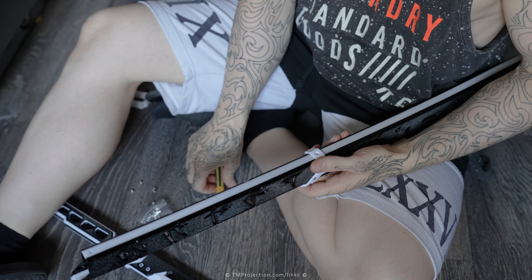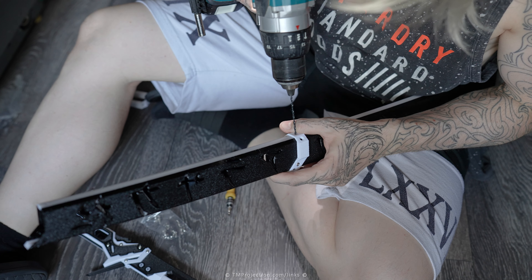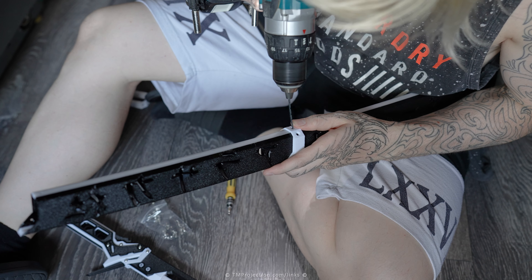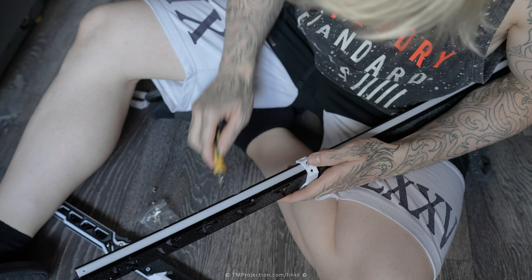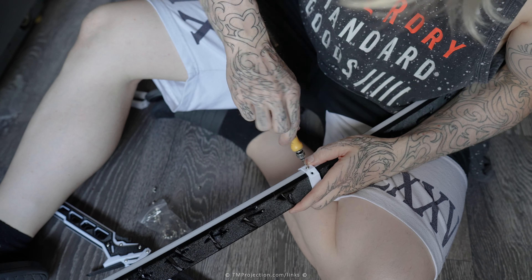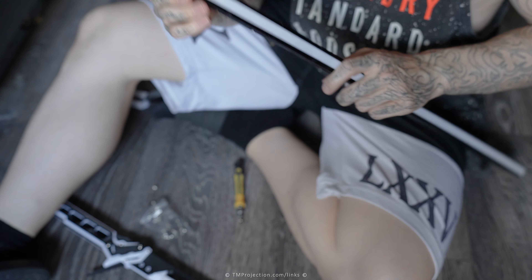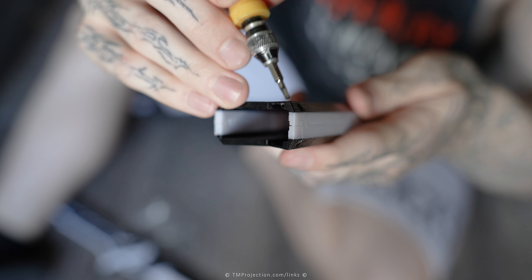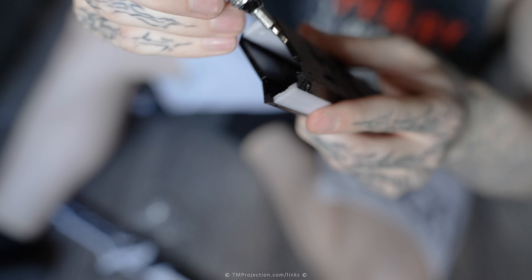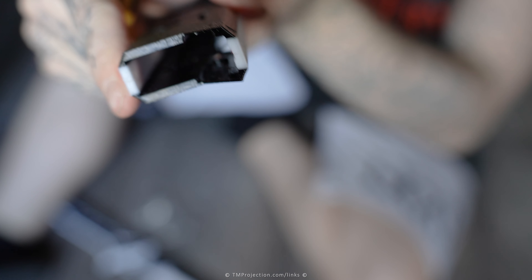I might have a little bit of trouble. The hole is really, really off — it's off by like one millimeter. So let's see if this can realign it. No, I'm just going to slightly drill it, which is what you're going to have to do anyway for version 1. So it's a good way for me to actually show you how I do it. Also, I think some of these holes are going to have to have the bolt slightly trimmed, especially for version 1, near the base. The reason being is because this is where the buttons go.